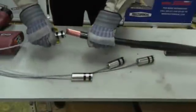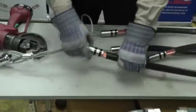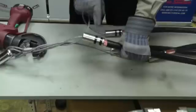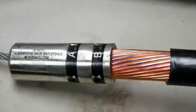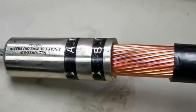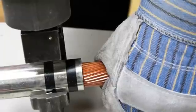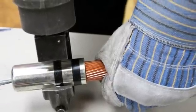You would then insert it into the shell. Once you've got the cables inserted into the steel shells, it's time to crimp. You'll notice that there are colored bands on each one of the steel shells — there's an A and B marking. A is the first crimp, B would be your second crimp. The colors on the steel shells correspond to the correct crimping die, which is pretty universal in the industry.